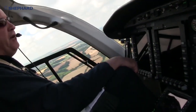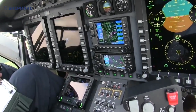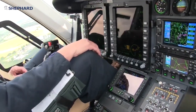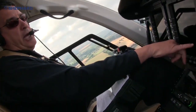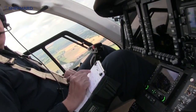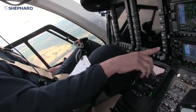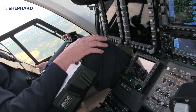I can sit here for two and a half minutes if I need to climb out or do something different. If I go into the higher range — the 30-second range — it tells me you're in the 30-second range and here's how long you can be there. The blue lollipop is where it will not let you over-temp or over-torque the engine. If I pull a little bit more power, it's going to drop the rotor RPM a little bit, but it's not going to let me over-torque or over-temp the engine.